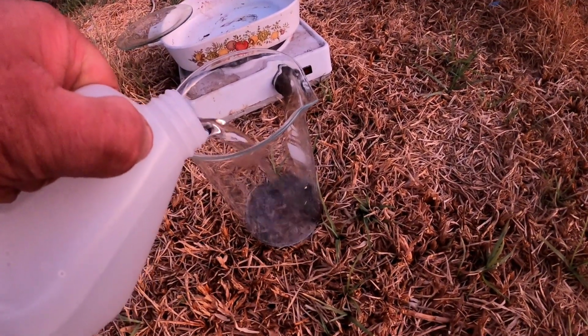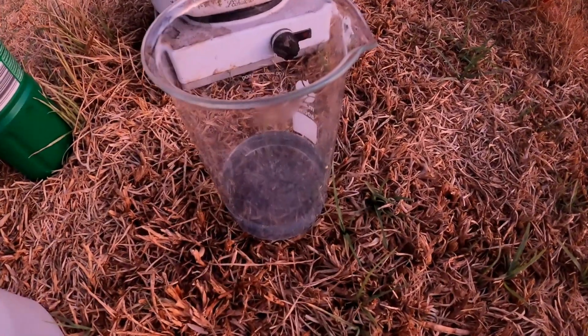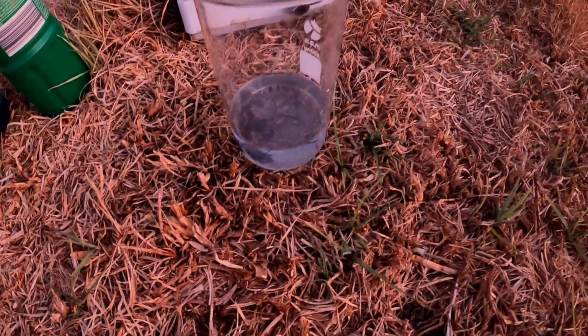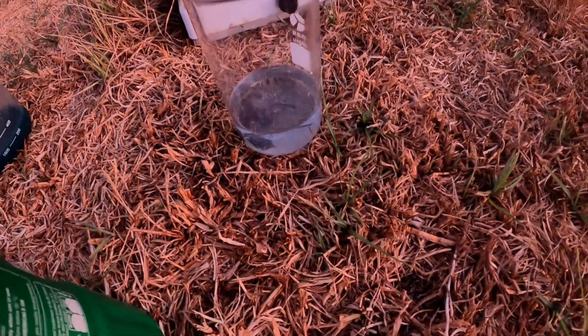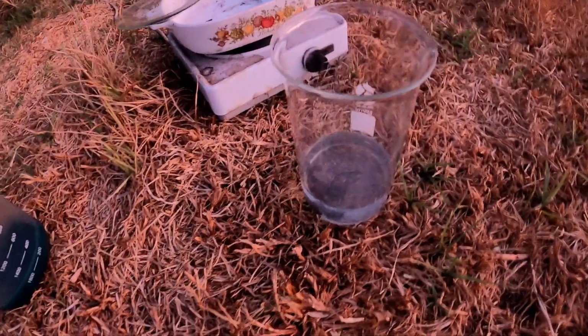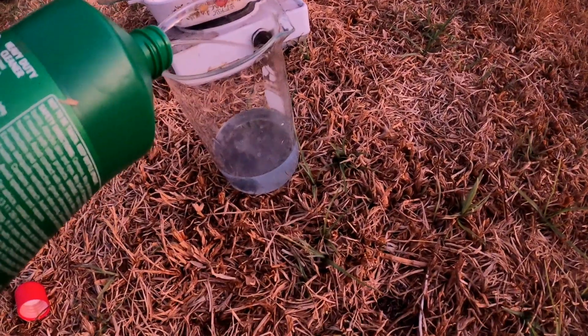Yeah, that's alright. There's not a lot there. I would have expected a lot more if that was gold filled, but it's better than nothing. So now I'm going to put some more nitric in there. And the reason why I'm doing this, not just leaving it all in there, is because I want to know if there's any more colour.